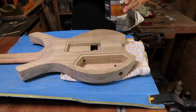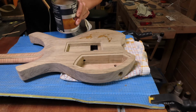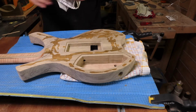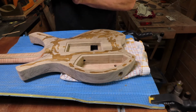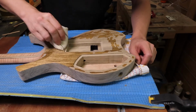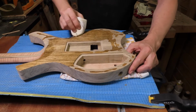So there we go. And I'm lucky it's warm today. Easier. This is how they do flooring. The hard wax oil is used for flooring, and then they use just a buffing machine and a few drops of the hard wax oil and buff it in with a machine. And this is essentially the same thing, but doing it by hand. And I'm using a circular motion to really push it into the grain.